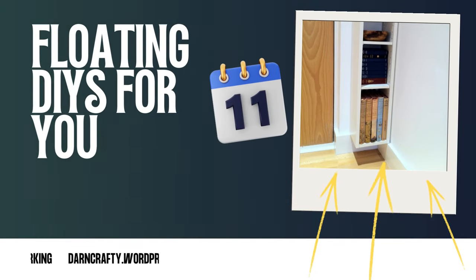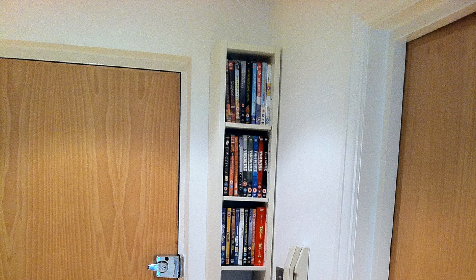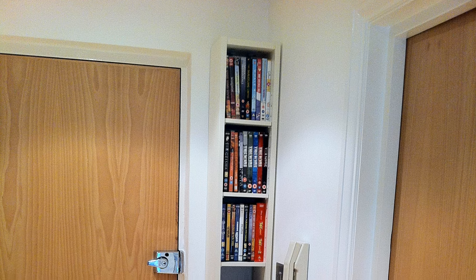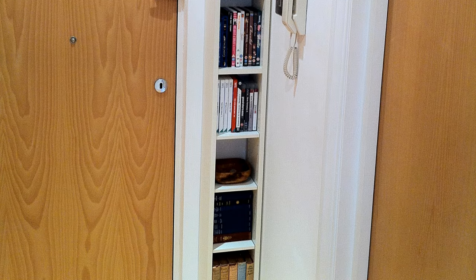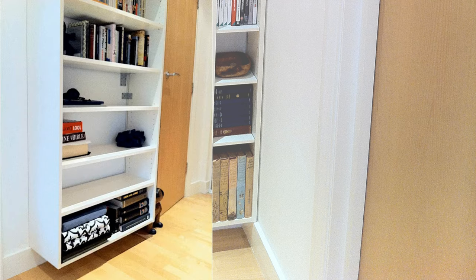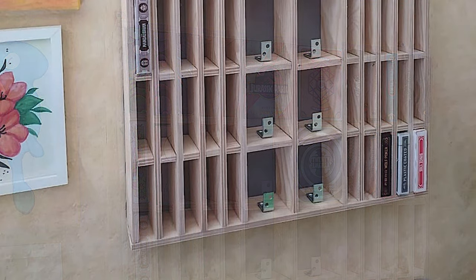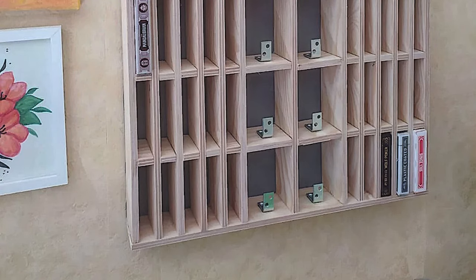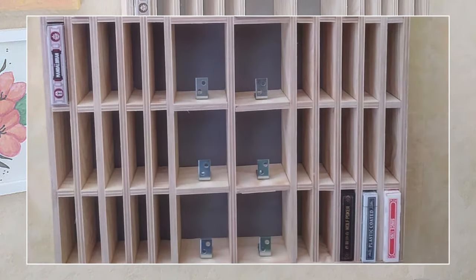Number 11: Two creative DIYs for your collectibles. For the first, remove the backing wood from an IKEA Billy bookcase, leaving a rectangular frame with one fixed shelf. Attach brackets and mount them to the wall using deep screws, then place shelves and finish edges with caulk if needed. For the second idea, cut wood at an angle, screw the back onto the sides, apply wood glue, and use clamps to hold it together. Sand the edges, add a finish, and attach the shelf to the wall using screws.